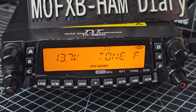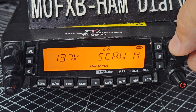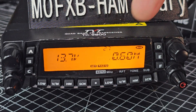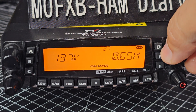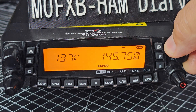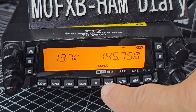Then we want the tone shift which is at number 27. To go back to 27 - if you're not sure what tone shift is - it says 'shift', press it. So when you key the mic it needs to go down by the correct amount, which is 600 kilohertz - it says M there for megahertz, but anyway. Sometimes you might want 7.6 for a 70 centimeter repeater, but that's where you adjust it on menu 27, so press. Right now if we back out - hit the menu - we still need to make sure the tone is on because I'm not seeing that the tone is on at the moment. We can set the power using this button here.